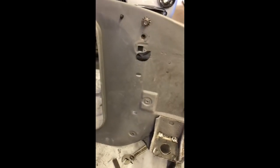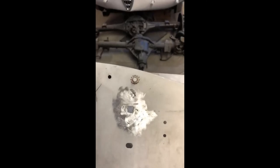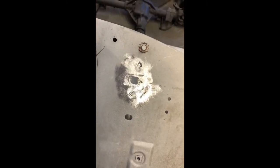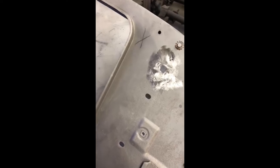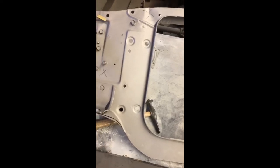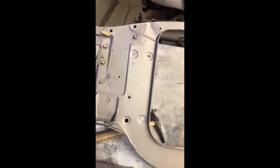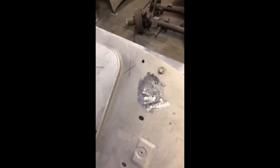Quick update: that's what our panel looks like after we fixed it. I could keep fiddling but I'm just going to give it a light smear of putty and it'll be done. That takes you through another process where we fixed three aspects of this radiator core support. I thought I was done, but then I started looking around and found more issues — there's a pretty good dent right here and a few other things to work out. Sometimes these little cars kind of wear you out after a while — like Columbo, it's always just one more thing.